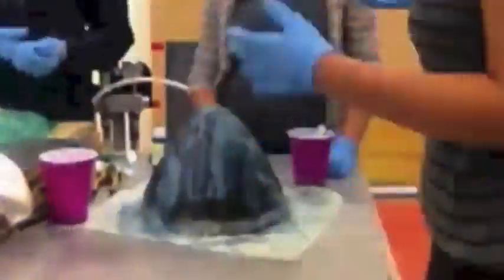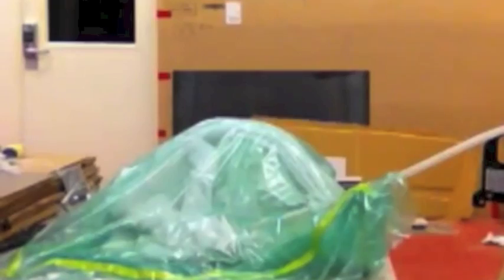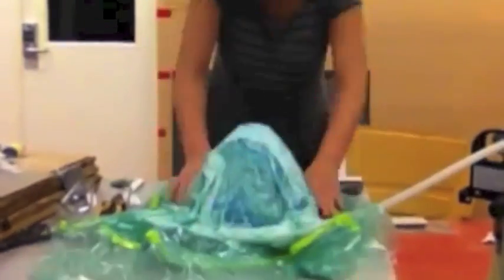We then continued to make our nose cone. The nose cone is made out of foam and was molded with a grinder, and then we used PVC foam — also very buoyant — to mold around the nose cone. To create a shell for the nose cone, we made it a fiberglass composite as well. The process for both the thruster plates and the nose cone involved laying sheets of fiberglass on top of a foam mold, vacuum forming it on top, and then spending time taking it apart.